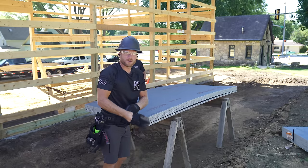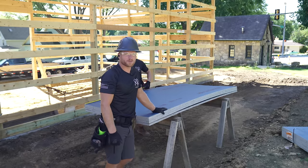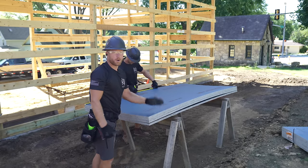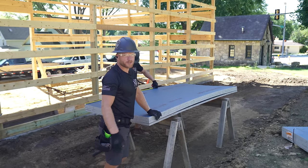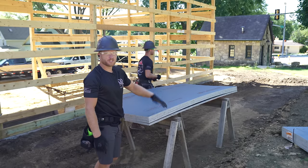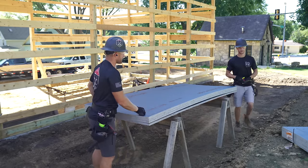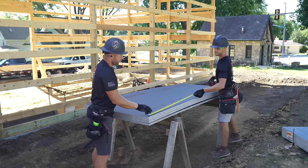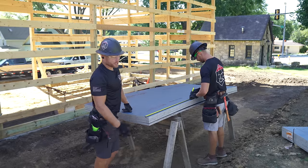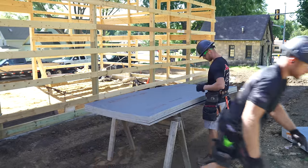One of the things we did when designing the structure was knowing we were going to use sheathing — we wanted to design the layout to be as efficient as possible and for the most part we're going to have almost no waste on this building. The back wall is about 14 inches taller because of the grade with the foundation, so we've got to cut these first ones down to 40 inches and also 88 inches, so we've got a nice four-foot stagger. Definitely going to use the track saw.